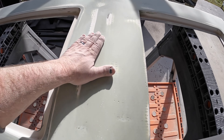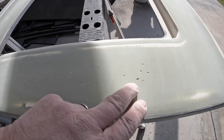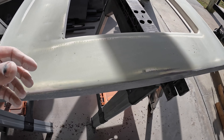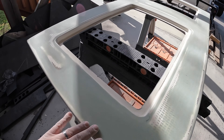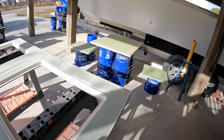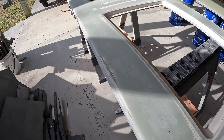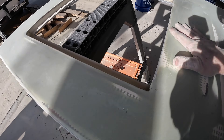I'll flip it right here so you can kind of see — there's like a little low spot there. All of this is really smooth, but it's going to get filled in. Some of these little pinholes right here, if this was just going to get primer and paint I would definitely put some more Total Fair on it. But since it's a deck plate I'll just prime this — the primer will fill that in, and then the Tough Coat non-skid will fill everything else in. No sense doing more work on it when it's just going to get walked on anyway.